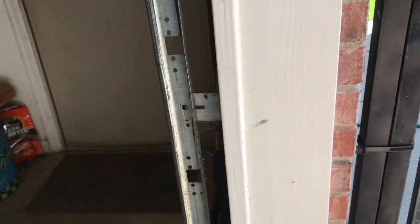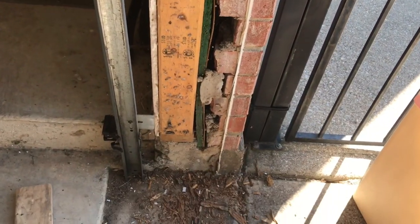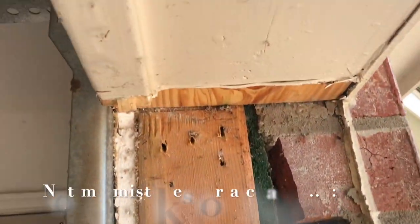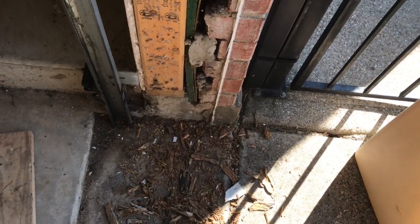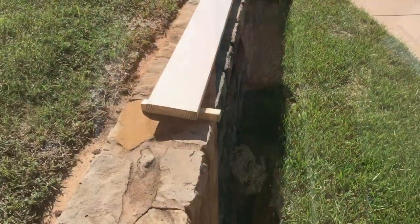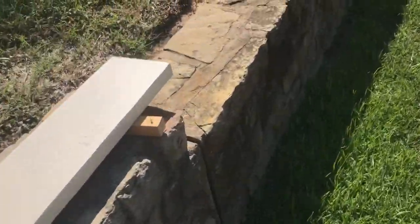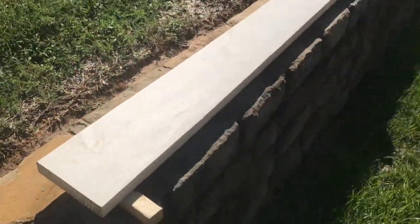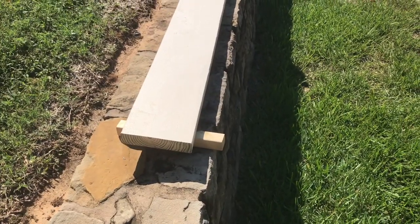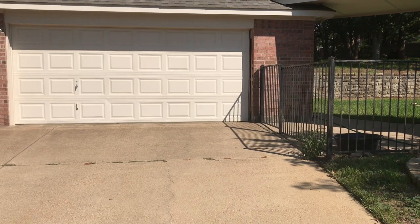I got the fourth piece off. Looking inside that section there's a lot of spider web remnants, bugs, carpenter mistakes, and nails. I'll clean up the caulk, measure it up, clean down here, make sure it measures properly, cut the board, and move forward. A little problem here: we've got a warped board. This was the board that was going to go in the garage. It's been out in the sun — it's pretty flat here but it's twisted. I think it's too much of a twist to get it into the garage door, so I might have to buy another one if the sun doesn't warp it back.